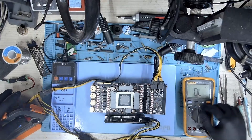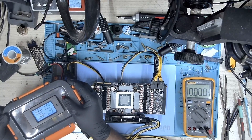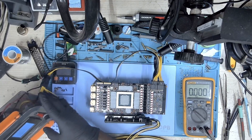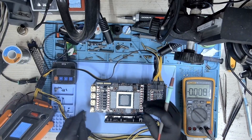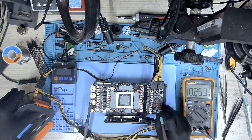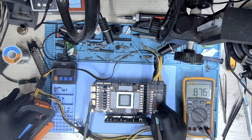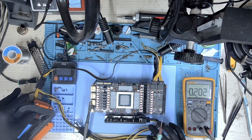Let's turn on the power supply and check if anything explodes — just kidding. The power draw looks normal at about 1.91 amps, which is absolutely fine and indicates that everything is present. That's surprising. Let's measure the voltages: 12 volt 8-pin is looking good, second 12 volt 8-pin — we have 12 volts.